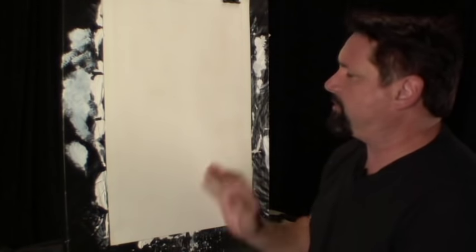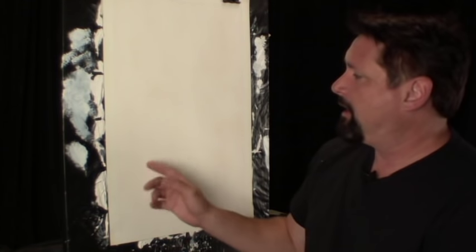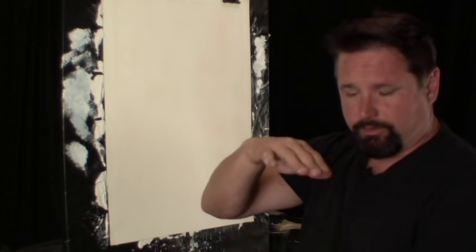The first thing I've done to get ready for my brick finish is base coat the surface using an acrylic eggshell enamel paint. Acrylic paint is made with acrylic resin versus latex, which is made with water. Eggshell is a level of sheen. Acrylic paints are more durable than latex, and sheens go flat, eggshell, satin, semi-gloss, gloss, high gloss.